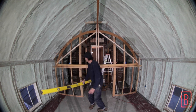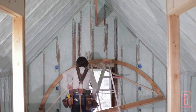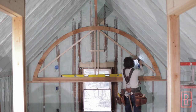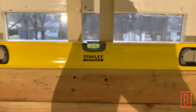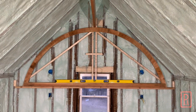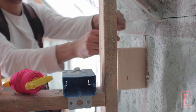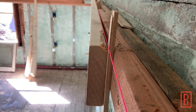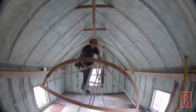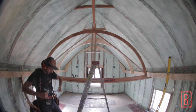Here's how it works: I can lift the jig in place and screw it to the LVL beam, which is my reference. I can then level the bottom beam, which tells me that the center of the jig is directly plumb from the center of the LVL beam. Then I can stabilize the jig to the gable wall, closet walls, or later to a 2x6 ledger. Now that the jig is exactly where it needs to be, I can start working out the geometry of the barrel vault — measuring the offset to existing walls to place the 2x6 ledgers for the arches, working out the arch template shape for next week's video, and using the jig as a ledge to hold up the arches during install while I screw and shim them in place.